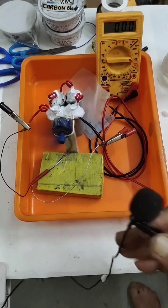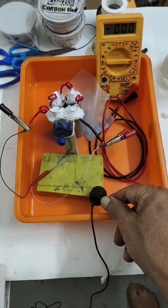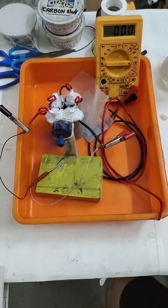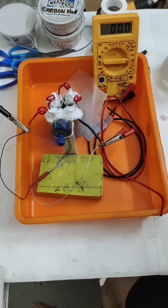The current output is around 150 to 160 milliamperes. You can see the motor running fine. This is the aluminium ion battery using aluminium chloride as the electrolyte, with sodium sulphate to boost the electrochemical stability window. That is why it is able to deliver 6.3 to 6.4 volts for four cells in series combination.